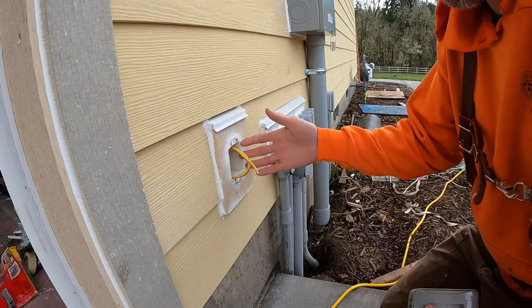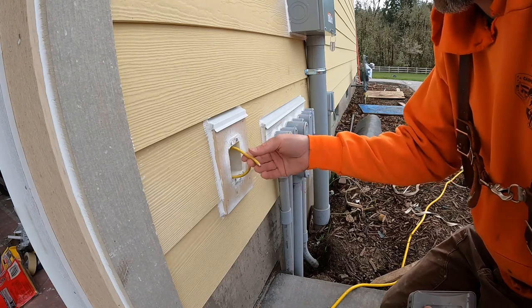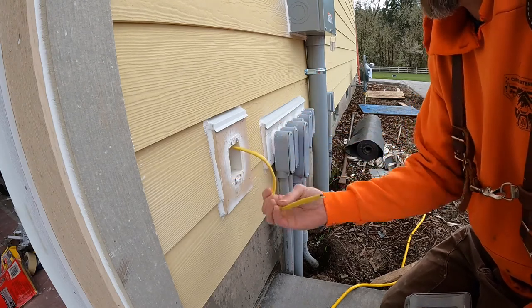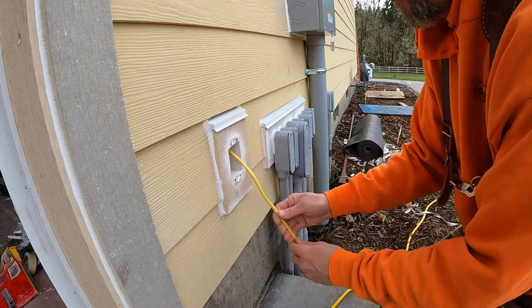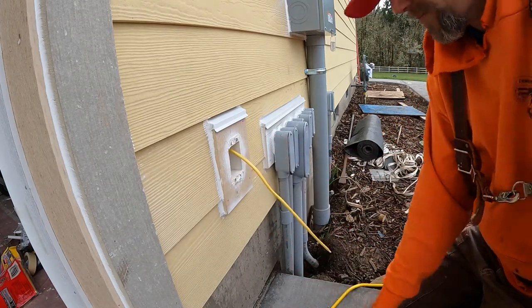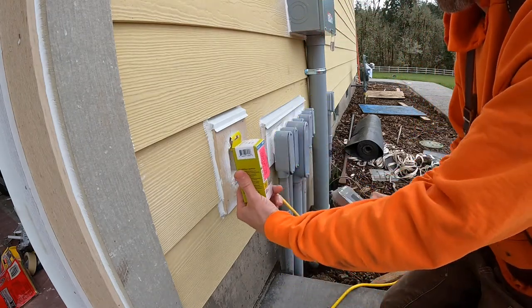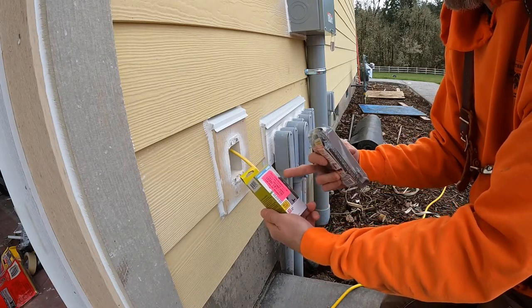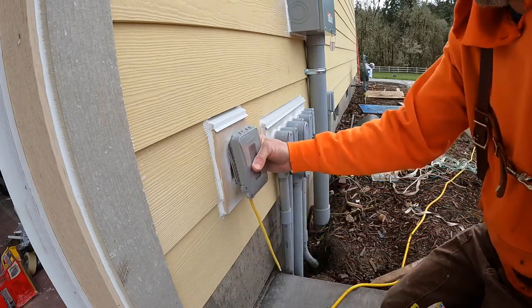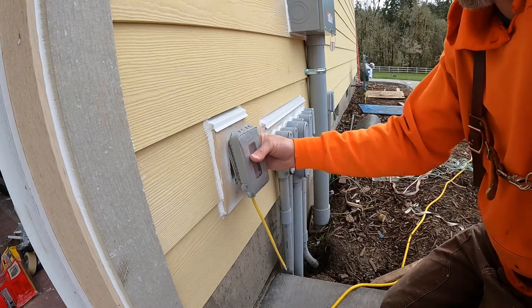So I elected to have a slim profile. You can go back and look at my videos on how you waterproof all this, so that to me is really important. Ran the wire, so there's just one conductor coming out. It's a 12 gauge, so yellow is typically 12 gauge. And I knew I wanted it recessed in there so that I can have all the components of the outlet in it and have a slim profile. I'll show you in a minute what the electrician provided.